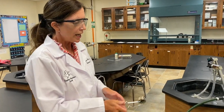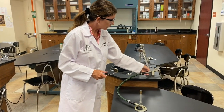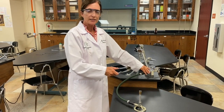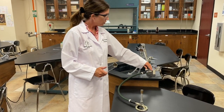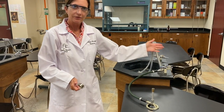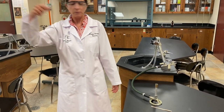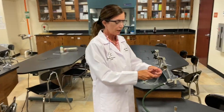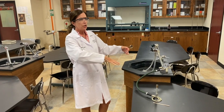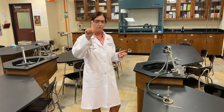In a minute I'm going to turn the gas on. If you turn the gas on, you count up to five. If this thing isn't lit by the time you count to five, you turn the gas off, you waft, and you wait. You never just leave the gas on because if the whole area fills up with gas and someone makes a spark, you're going to have a fireball. In all my years of teaching, I've had one fireball.